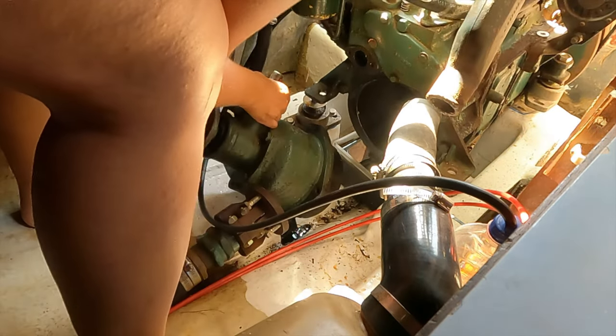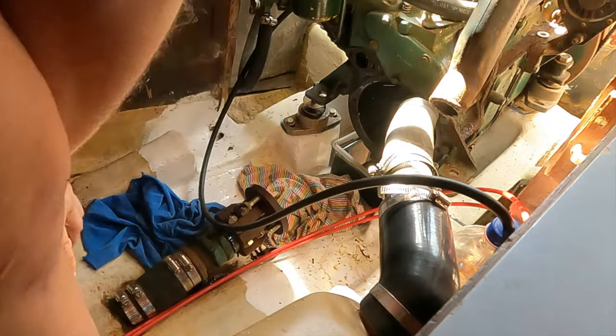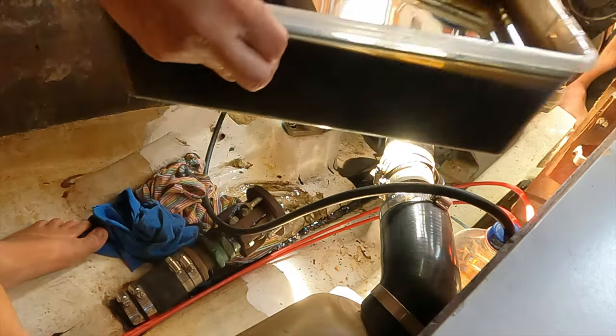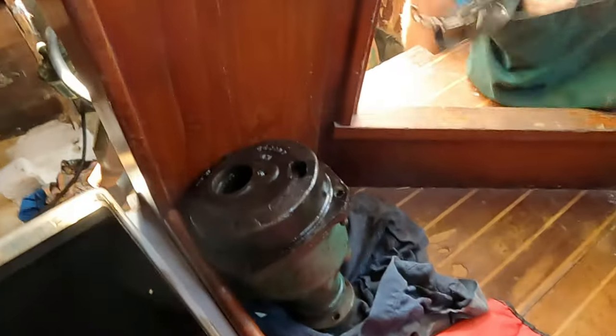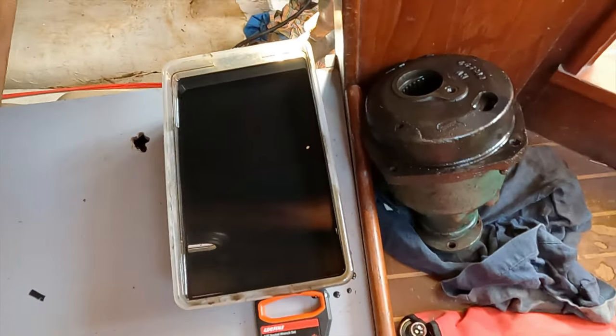We didn't have an oil change pump to take all the oil out, so just by cracking the gearbox off, we emptied the engine oil into a bin. The rest of the oil couldn't go very much further, as I put a plug to stop the rest of it from traveling into the bilge. But still, this was a nice and messy task. That's how much oil was in our engine. Used oil would go to the boatyard facilities, and the gearbox to the diesel mechanic.